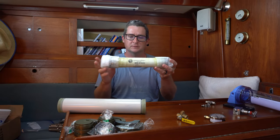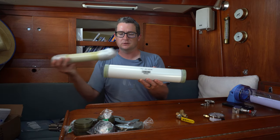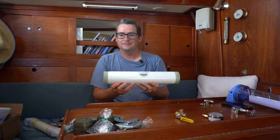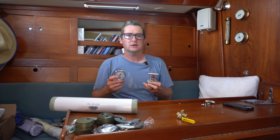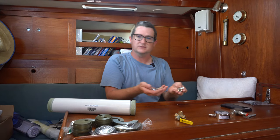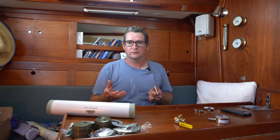We also have the actual membrane itself — it's a 24-inch unit which goes inside the pressure vessel. The pressure vessel consists of a thick fiberglass tube and some fittings. For filtration we're using a generic household-type water filter housing with a five-micron carbon element. To see and control the pressure we're using a gauge and a needle valve, along with high-pressure stainless steel fittings. The needle valve makes this a manual system, and that's where we save a lot of cost — using a simple valve instead of a pressure-compensating pump or special relief valve that some commercial systems use.